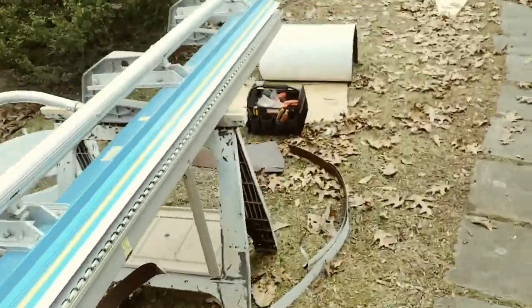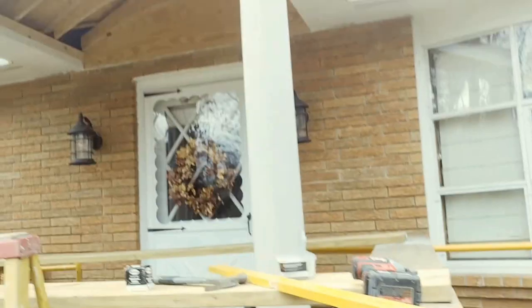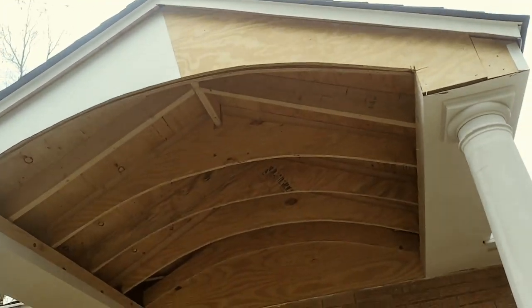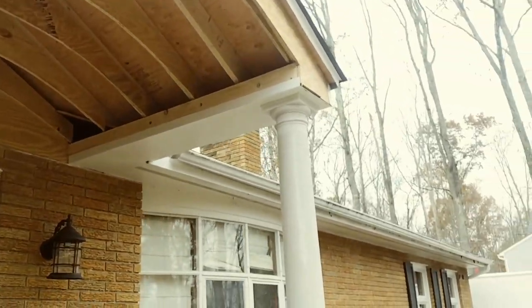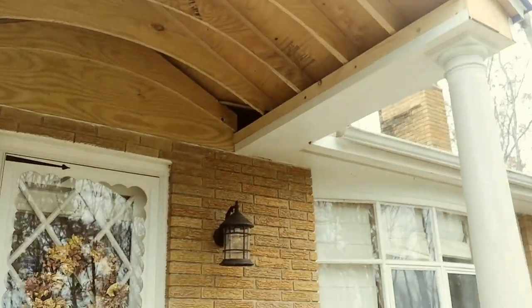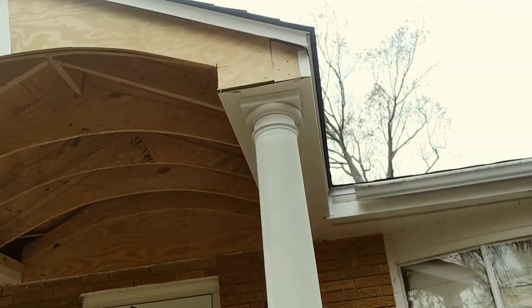Now here we are all set up — there's a bend in the middle. I tacked up the pieces and traced the back side to cut, making it in two halves because it's larger than 24 inches wide. I bent up the sides, and there will be one more on the inside edge up against the soffits once the soffits are in place. I've got one more big piece on the back above the door, and then we're ready for soffits and we'll put some trim around that.